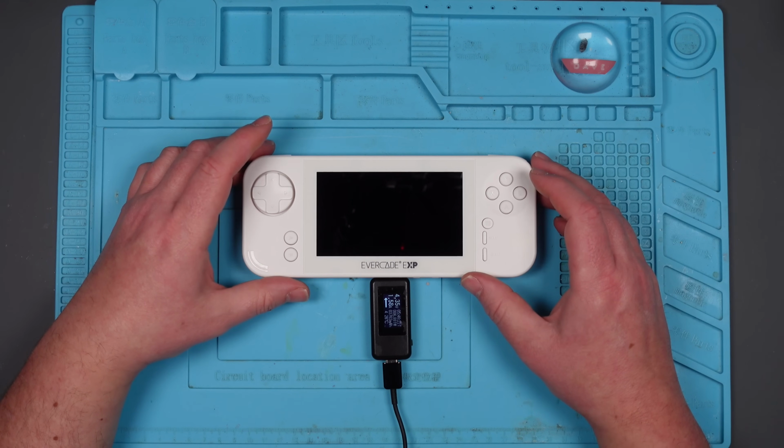Right, I think we're back to the original fault now. Because it came on when it was plugged in, but it didn't stay on on the battery. And now it won't turn on with the battery. So this thing must have had two faults: the original fault, and then that shorty capacitor as well. Unless maybe it's one and the same thing. Maybe that capacitor's now shorted again, and maybe it's the chip that's at fault.